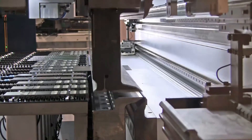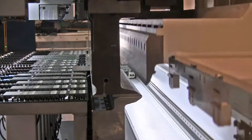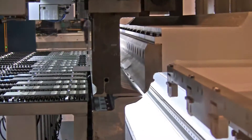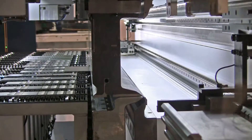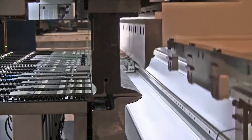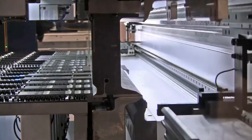And how about gauging? As I'm looking behind me, I'm seeing what looks like sort of standard back gauging, but I understand this operates at a much more sophisticated level. We actually have technically a five-axis back gauge back there, so you are allowed to do a little bit of offsets, but once the back gauging is done, the front manipulators take over the rest of the action on the bend.